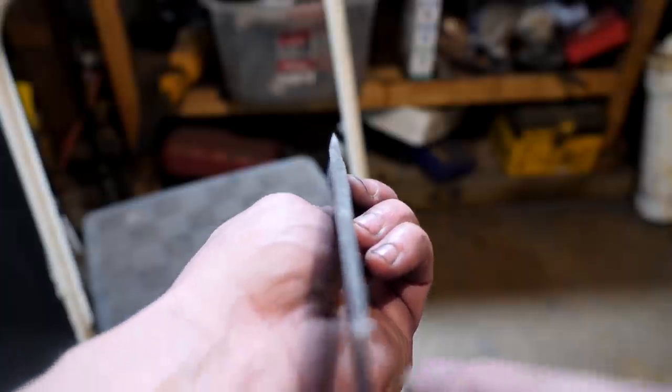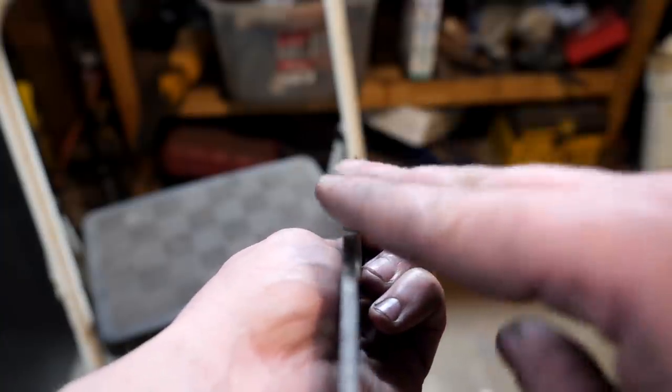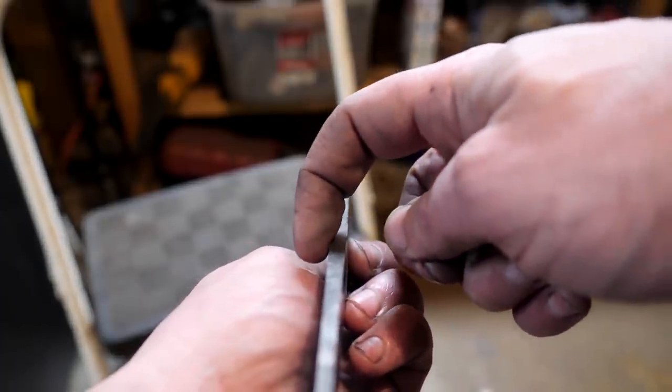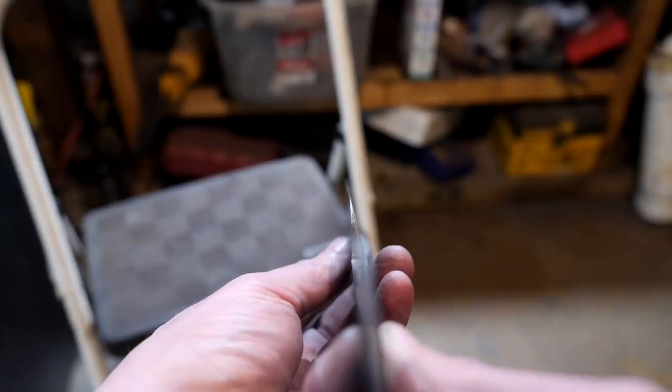When you look down the spine, things look wavy and the knife doesn't look straight. And that's because the sides haven't been ground. There are lumps and bumps along the sides as well as the spine surface itself, which is somewhat wavy, meaning nothing looks straight, parallel, or perpendicular when you look down it. But if you flip it over, it reveals a straight line from the butt of the taper tang down to the edge of the knife, so we're okay.